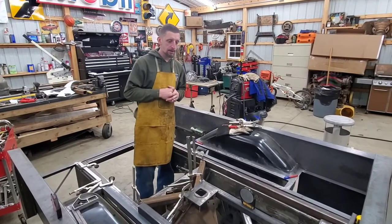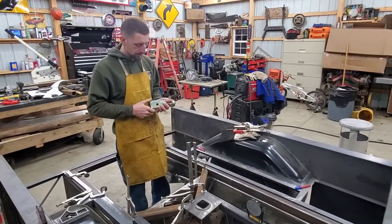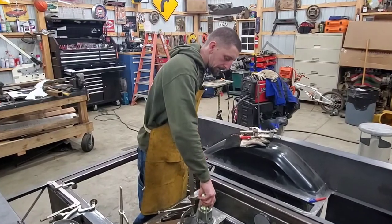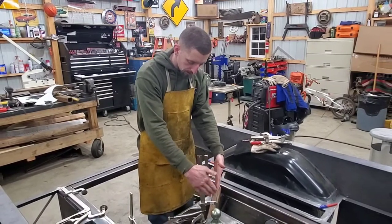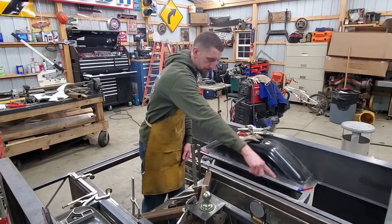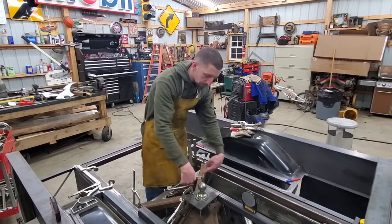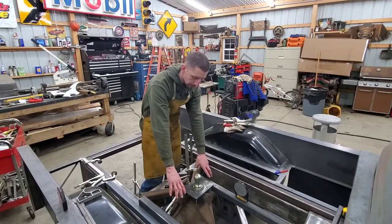As far as the how, I'm still trying to figure out the how part. The foundation for the gooseneck trailer hitch is a B&W fabricated, pre-fabricated gooseneck turnover ball, and then I'm just adding my own framework to it. I'm going to run my framework crossways into the mid cross member back here. I have another mid cross member up in front, just behind the cab, that I'm tying it into here.